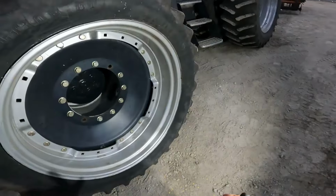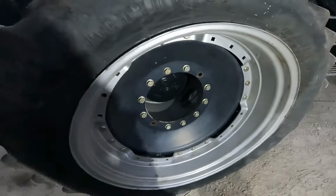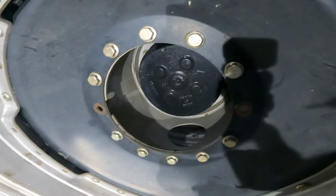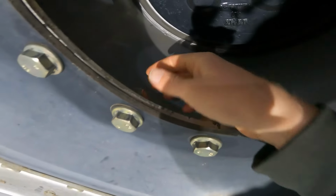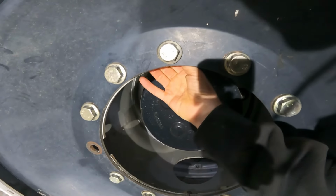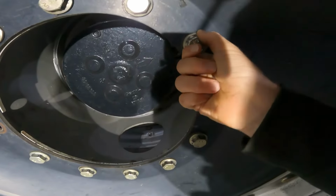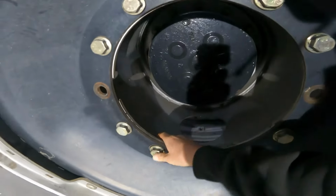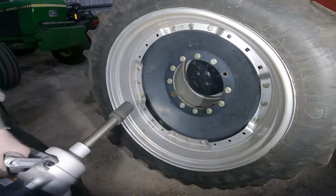Because I'll just come up here with the forklift, come up underneath it, then just pick the tire up like that. A whole lot easier. So now I gotta get these bolts broke loose. They do have a big cap nut on the back. So what I'm hoping is I can take and spin them loose with the big 1-inch impact, and I'll grab the 1/2-inch so that way I can throw a crescent wrench on the back and just spin them the rest of the way out with the crescent. So let's get started.